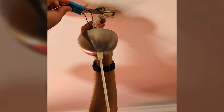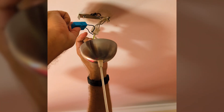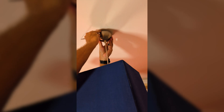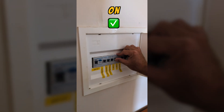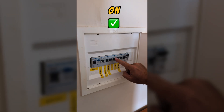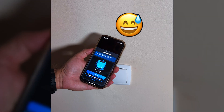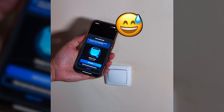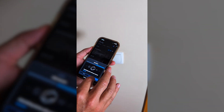We just want the live and neutral so that we can install the Shelly bypass, which is included with the Shelly 1L or Shelly 2L. There's no particular order — we just need to connect these two wires, one to neutral and the other to live. Now we are ready. Close everything back up, go to the circuit breaker, and turn it on.